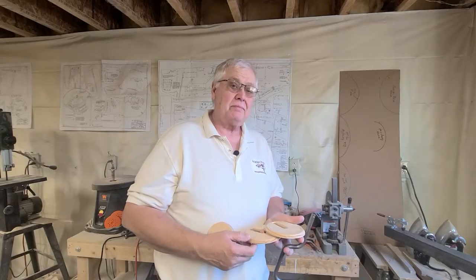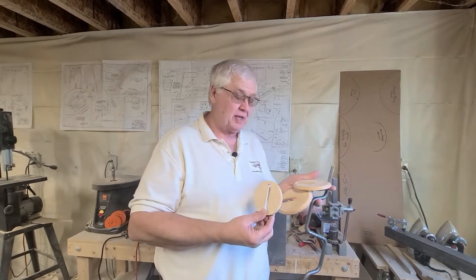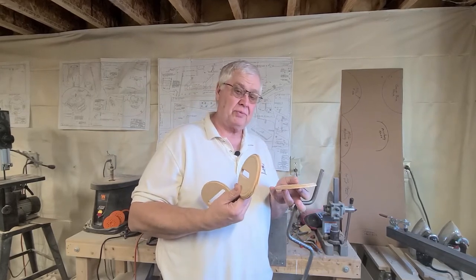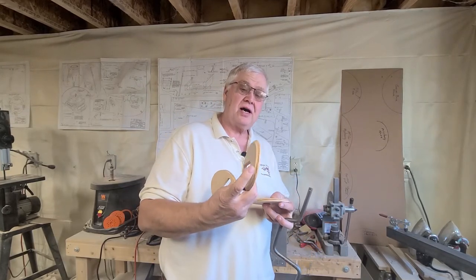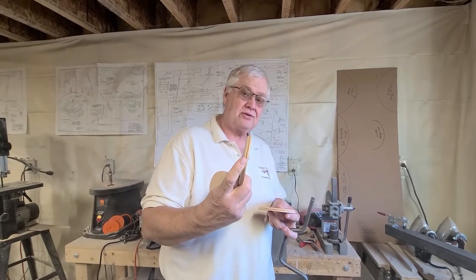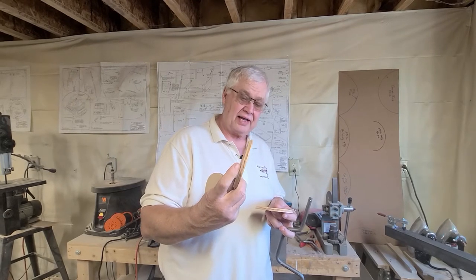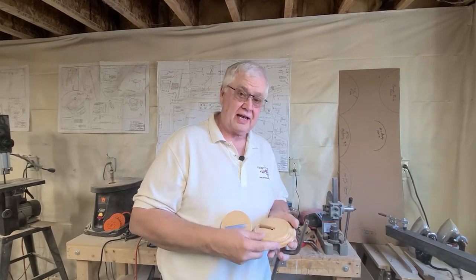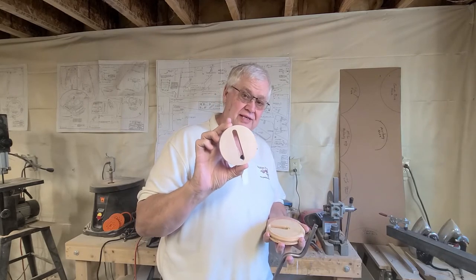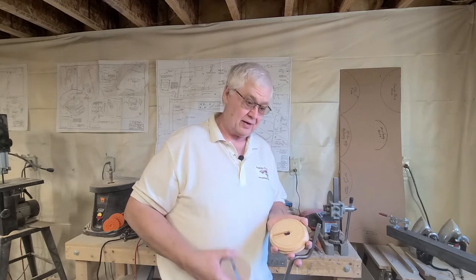We're going to show you how to start on your pedal crank pulley. Here's the four pieces you're going to have. You got your center pulley and your two outer pulleys. They do not come chamfered here on this edge. So make sure you chamfer this with a file or sanding on the edge of this. Another thing I like to do, this center pulley is 4 inches in diameter. The outer pulleys are 5 inch in diameter.